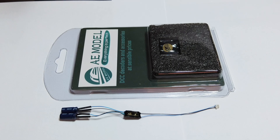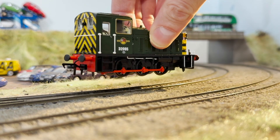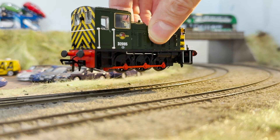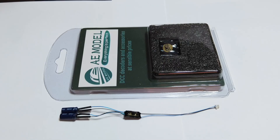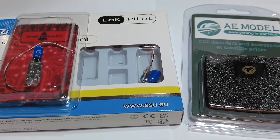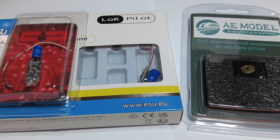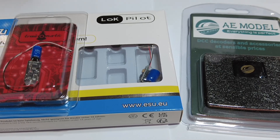With the Zimo ones, as far as I know you don't have to change any settings — it's pretty much plug-and-play. You can adjust the time it runs for though, similar to LokSound decoders. Some people might only want it to run for half a second so the loco doesn't travel too far if it loses power. Hopefully this has been useful. Please like the video, and if you want to leave a comment that would be appreciated too — it all helps more people find it and shows me it's worth making more.